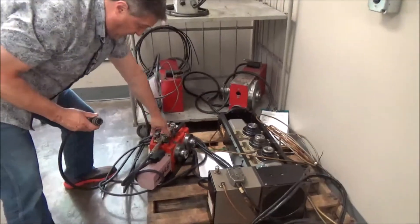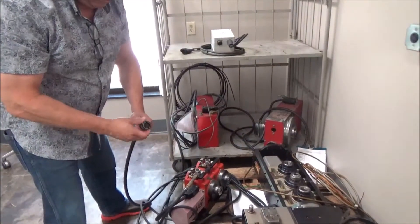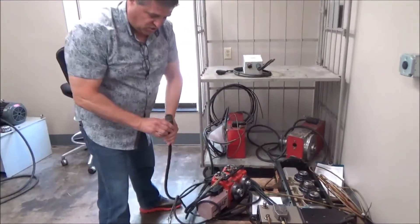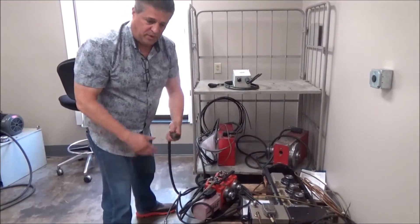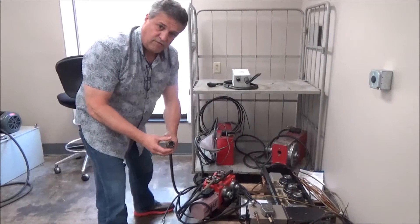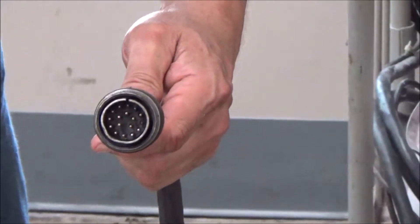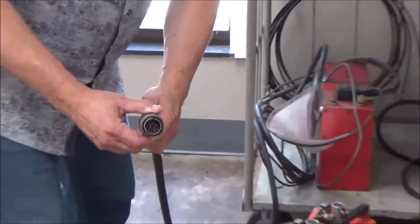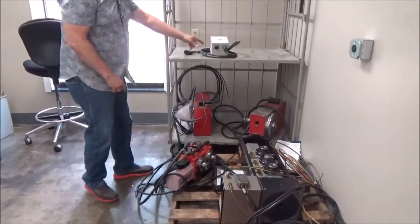Another indication is the color red. Most of the red ones, unless they've been rebuilt and put a new drive in, will be brush drive — these are the older brush DC drive. Some people say 19-pin; I don't count the pins, it's just this configuration. If you can see it in the end of this connector — that would be a brush drive.